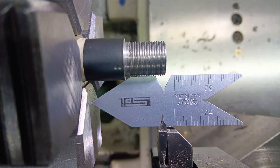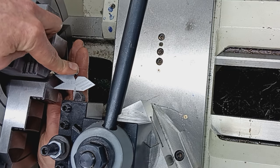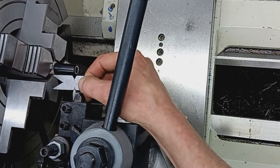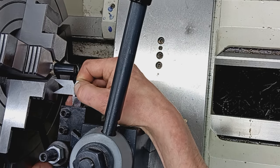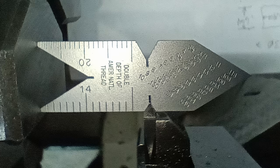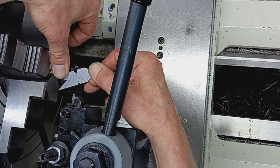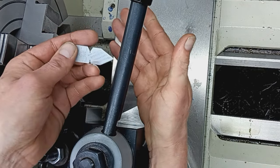We've got no light gap between the work piece and the gauge. Now, if you know anything about rifle barrels, you know this is tapered slightly. So we're going to back off just a little bit and do the same thing — hold this squarely against the cutting bit. These two little legs can actually be squared up to the chuck face to double check. Both legs are sitting flush and flat against the chuck face, and the tool is square to the work piece. You can't really rely on just the barrel face because it's tapered — that would be wrong. There are other ways to do this, but what I want to show you is that I actually do use the proper method for threading.